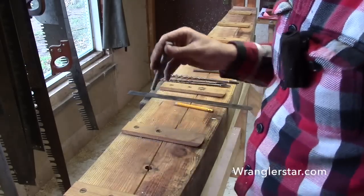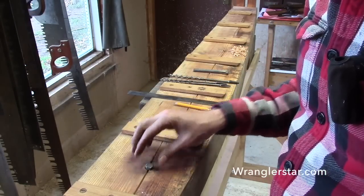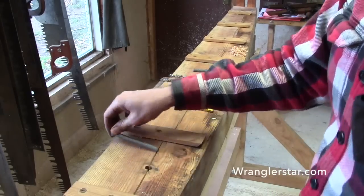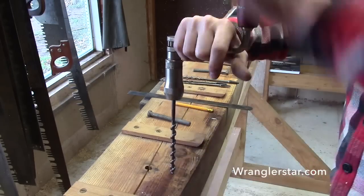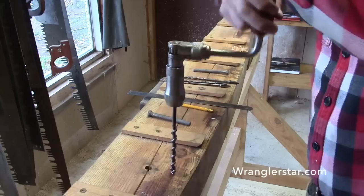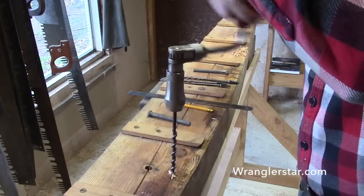The holes that I had here, I've only filed one saw on this bench, were for a larger saw, and this one sits too deep in here. So what I'll do is come up here 6 inches and we'll put another hole. This is pretty common. When I was in Montana in the saw class, the benches that we had used had lots of holes in there, all different configurations for all different sizes and shapes of saws. So this is just part of the process.